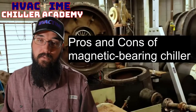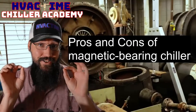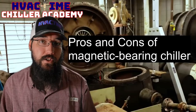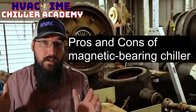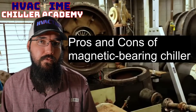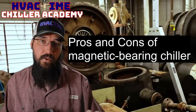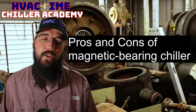You've got to be very specific and precise. With a turbocore, for example, if you don't do that bearing calibration just right and you accidentally save a bad calibration into that compressor — it can be fixed, but it's a pain. You dug yourself a hole when you were actually better off with the first calibration you started with. If you don't know the little tricks, like unhooking the cable so there are no inputs and nothing else can disturb it, you get in trouble fast.